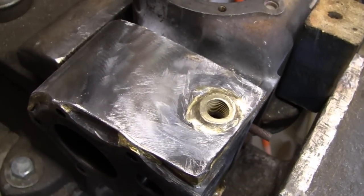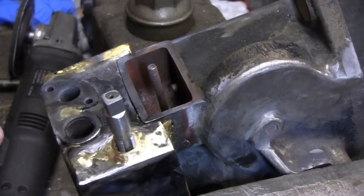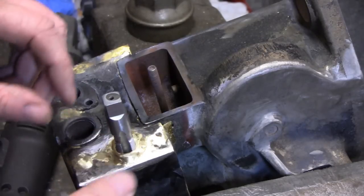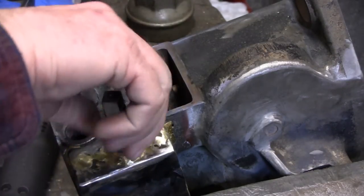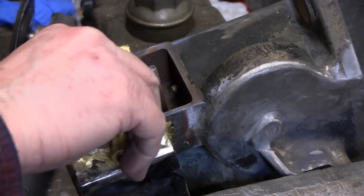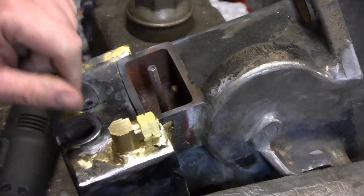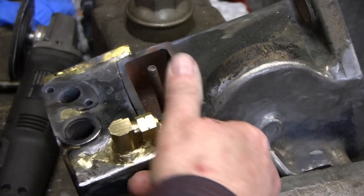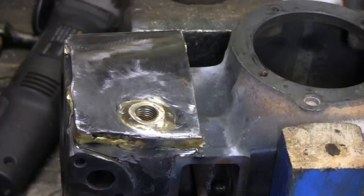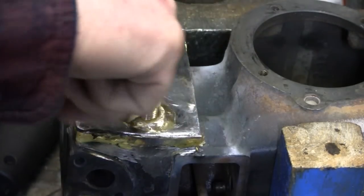We cleaned up the second fitting and we like it. It's a little different because this side was higher, but epoxy will take care of that. When you cut the fitting down like that it has a tapered quarter-inch pipe thread, so you have to re-tap it because the hole ends up too small for the fitting. Let's see if it works — there we go, compression fitting on the other side, that's going to be our feed.